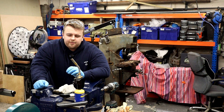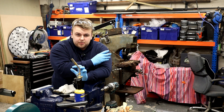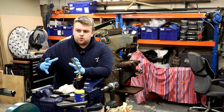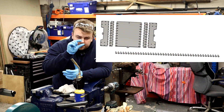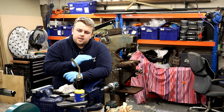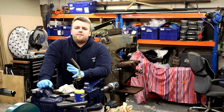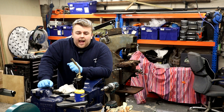Getting on to my design — I started off by drawing sketches with rough basic X and Y dimensions of the base of the milling machine. I then drew everything up in Fusion 360. The original intention was to have a very strong welded-together assembly with lots of small gusset plates supporting each level of the machine, plus castellated joints. It's a very intricate design and it's way over-engineered for what it needed to be.